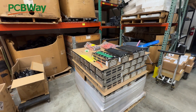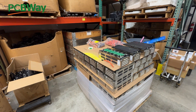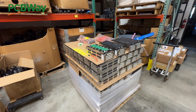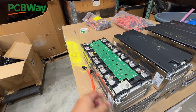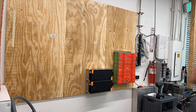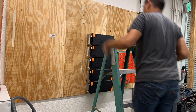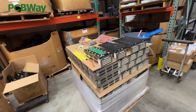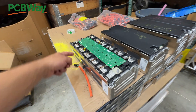Hybrid battery modules are big and heavy — high power but not very energy dense. Fully electric car batteries are very energy dense but lack the output power of hybrid ones. These Jeep modules are right in the middle, and they're small, light, and look great with their covers. Here's a quick DIY power wall mounted on the wall — and they look really good at the end.